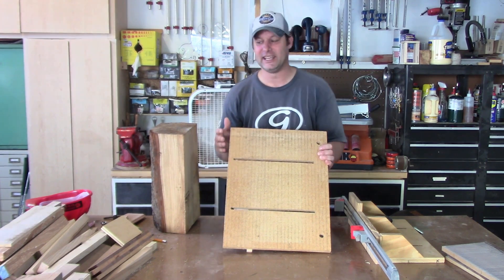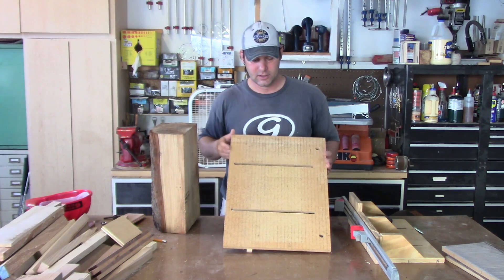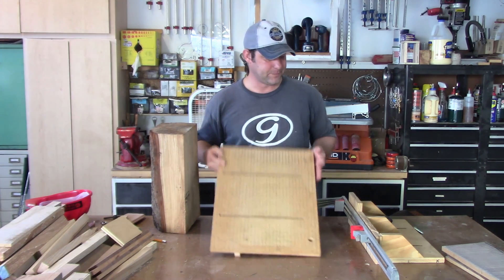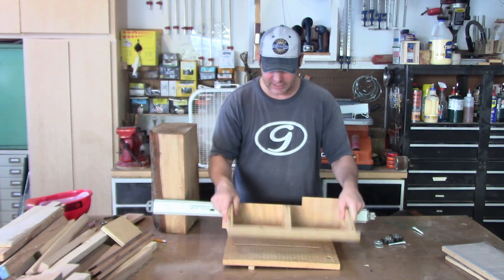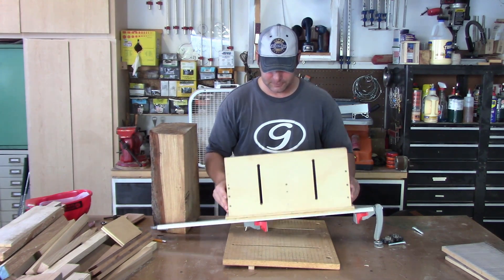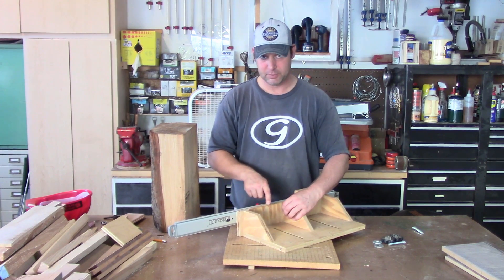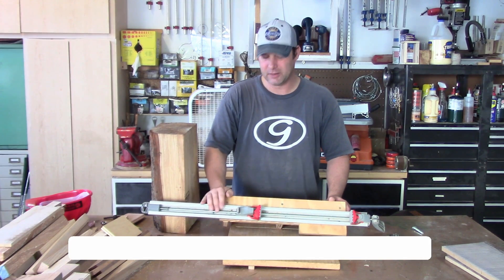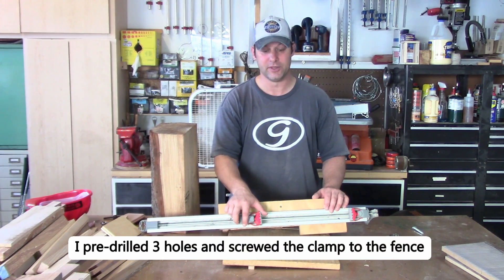Those have worked out really well so that I can get a piece cut down to whatever I want — if I wanted a half inch I can make it a half inch, if I wanted three inches I can make it three inches. I also have two holes here just to hang it up. The fence I made out of some leftover plywood and again I have those rounded-out dados for the bolts to slide through. I made some good strong corner braces to hold this fence perfectly square, and this clamp from Harbor Freight — probably about ten bucks — holds the log pretty secure when going through on the bandsaw.